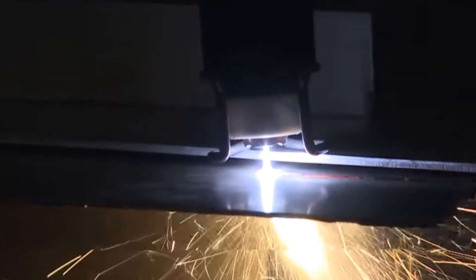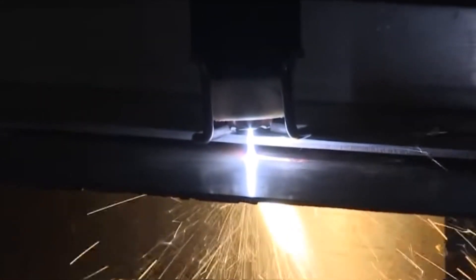Blowing through this spark you've got compressed air, and that compressed air gets so hot that it ceases to be a gas — it goes into a plasma state. Plasma is just a fancy name for superheated gas. So it uses the electrical arc to superheat the gas that comes out of here and that gets blasted into the metal. The compressed air also cools the torch so it doesn't melt, and it blows the molten metal out of the way.